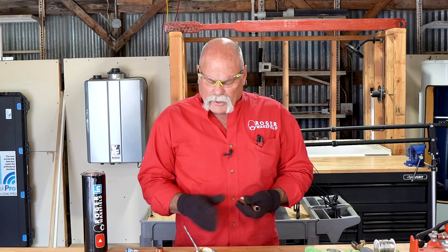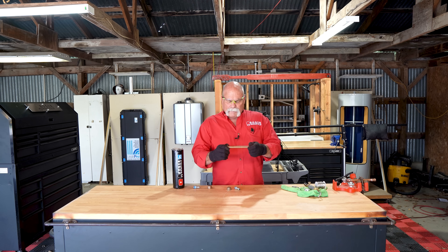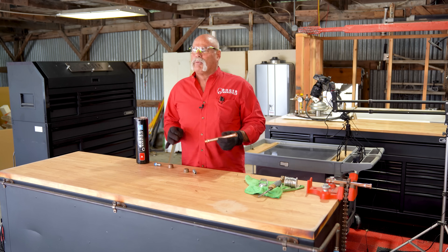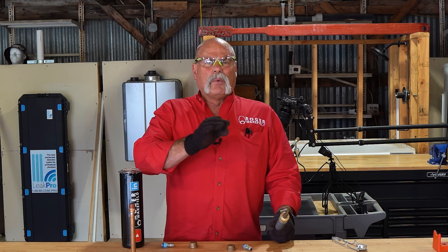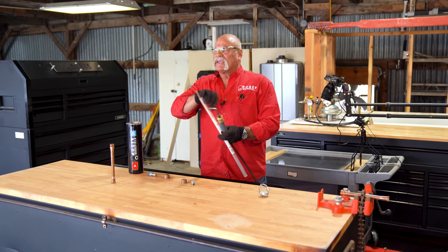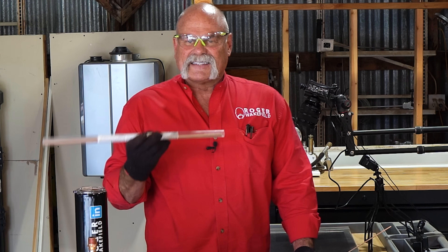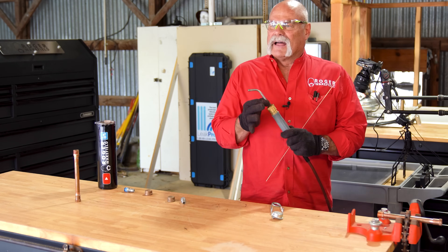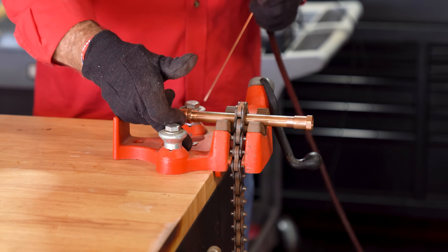One of the big differences in soldering and brazing is flux — I don't use any flux for brazing. I clean it up, put my fittings together, and now I'm gonna braze it. I've got an A5 tip on here, which for silver solder will work for quarter inch to three quarter inch. We're doing half inch. I've got my rod out — this is a Stay-Silv 5, which is a BCup-3. An A5 tip works anywhere from a quarter to three quarters.